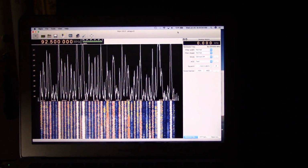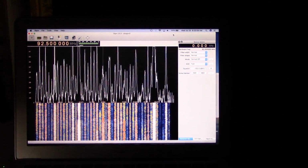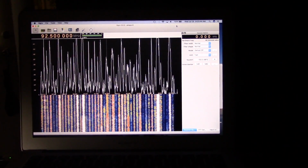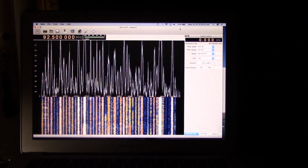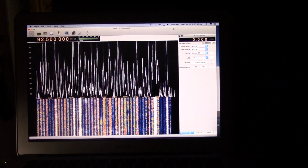and having a good strong distance station in that. And then there's about 10 frequencies, the really obvious ones you can see on here, that will be very difficult to get sporadic-E because the local is strong, and because it's so strong with reflections off of the house and the mountains and everything else around here, it's hard to completely null out the station just by rotating the antenna.